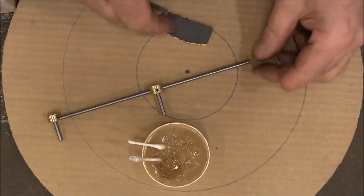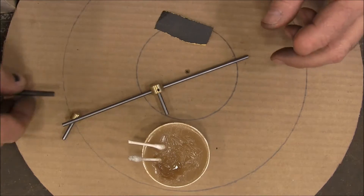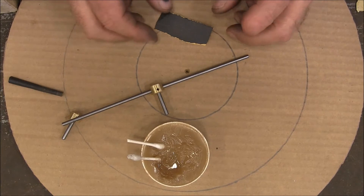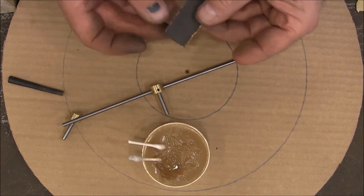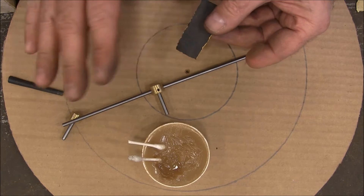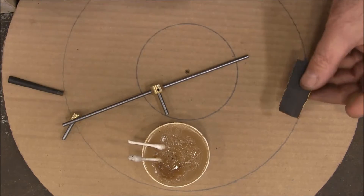I'm going to take a little bit of sandpaper and clean these ends, then get them fluxed, put them all together, and get it soldered. The whole thing about this is cleanliness — it's got to be absolutely clean. You want to take a piece of clean sandpaper that doesn't have any oil or anything on it, clean these ends, flux them, put them together, and then solder them.